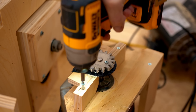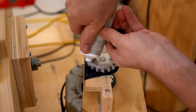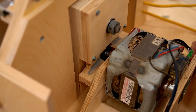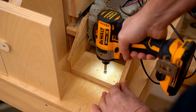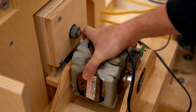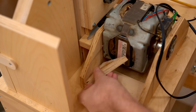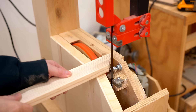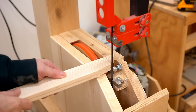But I've used it for about two weeks in the meantime and I think I am going to keep it. So what I'm doing right now is temporary — this is all very quickly rigged up to hold that lower cover on, to close the gearbox and keep the grease in. To keep the motor from turning I made these triangular blocks that'll just glue on, and then I'll fire in some pins to hold it there. After the glue dried I was able to start it up — you can see that it stops the motor from twisting and I don't have to have my hand on it anymore. I did a test cut to try it out, and it works perfectly.